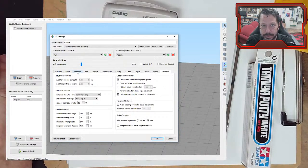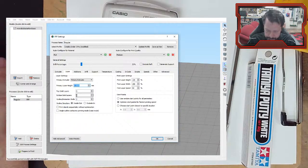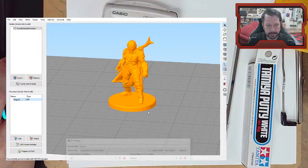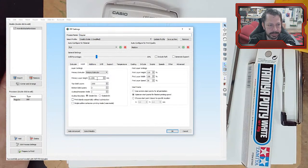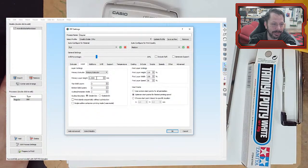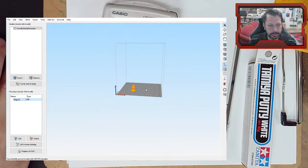The layer height is 0.12mm - one of the magic numbers for the Ender 3 and about as small as I can print with this printer. The little Mandalorian figure came in pretty small. Let's go to 0.12mm layer height and use our trick of setting a thousand top layers so the whole thing prints as solid top layers.